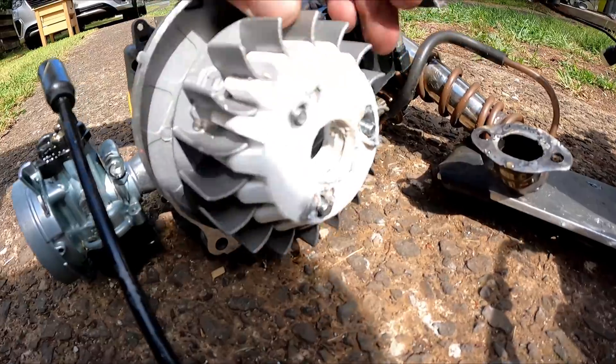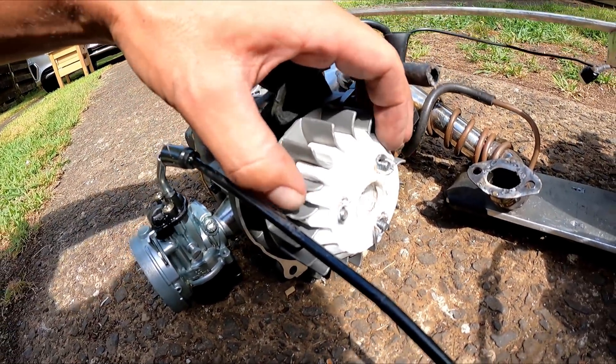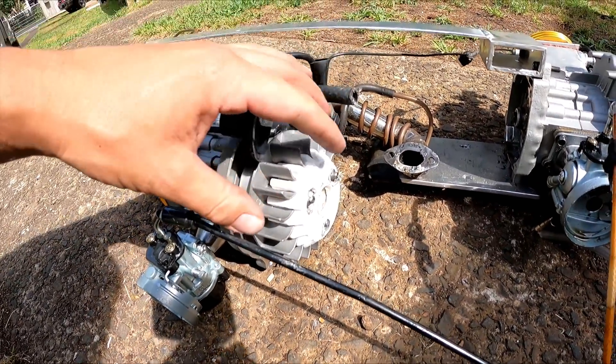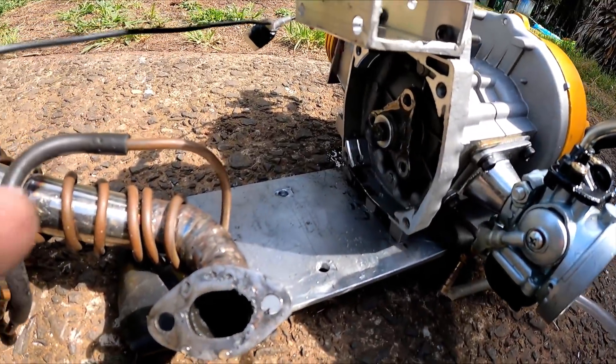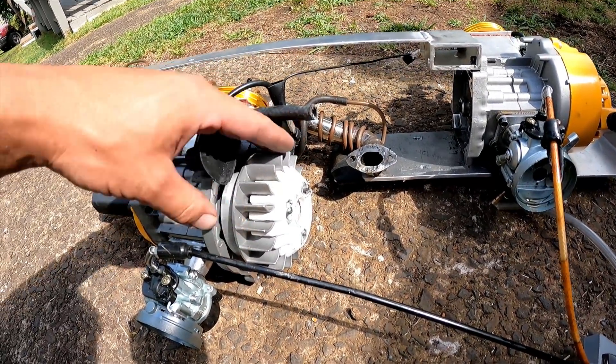All right, diagnosis time. Look what happened — I thought the coupling had broken, but it hasn't broken. The bolts just wound undone. It's my fault for not doing them up tight, but you don't do the bolts up too tight because they're pulling into plastic. So if I just put Loctite on there, I'm sure it would hold. The coupling is going to work — it's great.